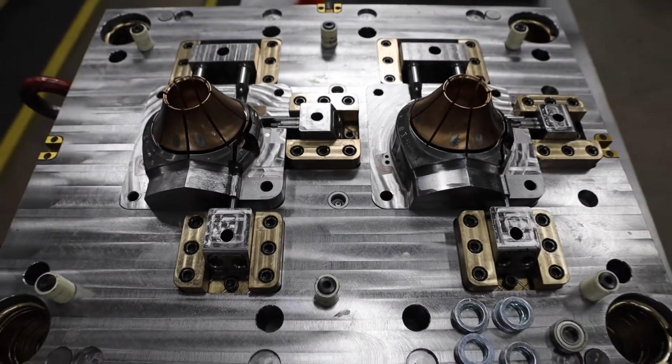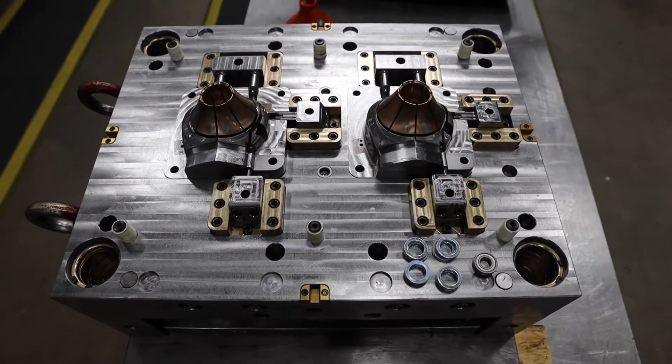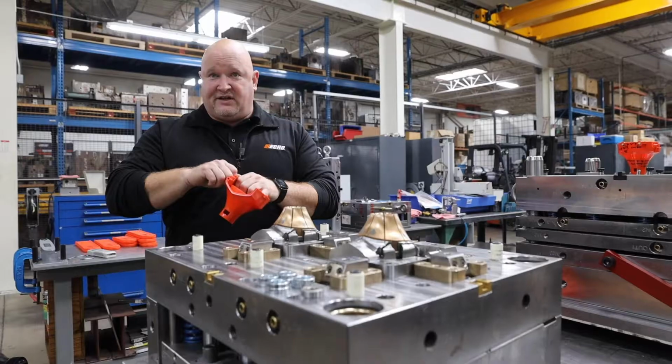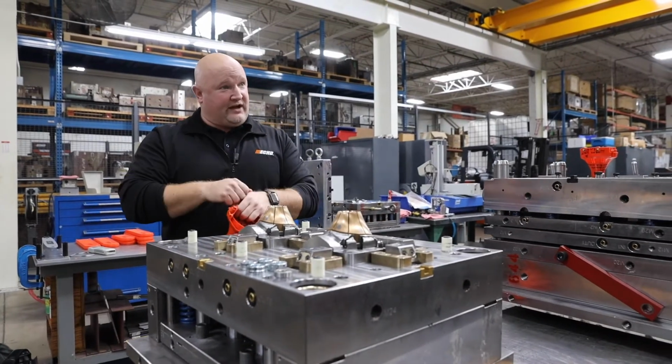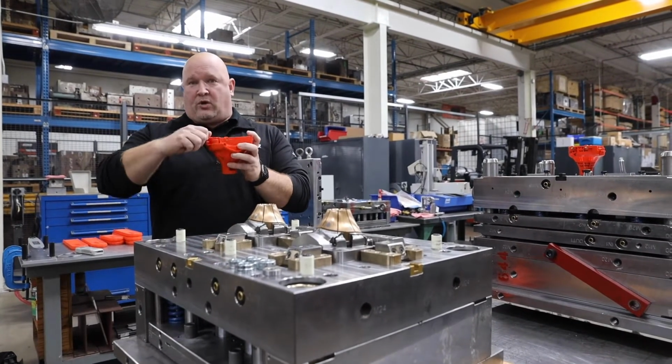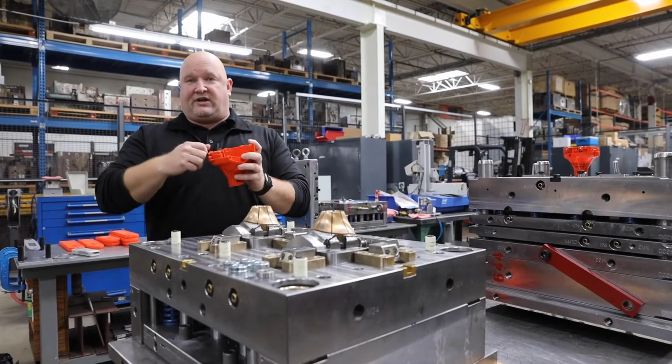If we're molding these and building the molds in-house when applicable, we are maintaining the molds so that we don't have flash. Now we don't have to trim the parts. We don't have risk of cutting. So there's your safety improvement. From a quality standpoint, we're reducing the amount of flash or gouging we could have from actually cutting the part.